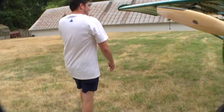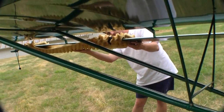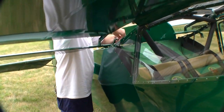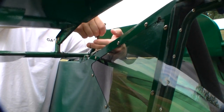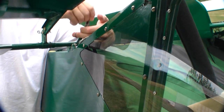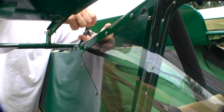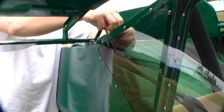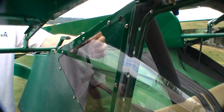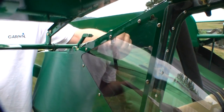Now let's do this other side. Here are the wing pads I showed you — I didn't put the other one on yet, but if you put it on ahead of time it's a lot simpler. I'm going to turn this flaperon loose, take the safety pin out, and back my bolt out with my little wrench. Put my wrench away and back the bolt out. Again, this is the important one — get this forward. It will kind of stick there usually, but sometimes you'll look and it's way back. You can see how that will bend up something, so don't do that. Put that up there.